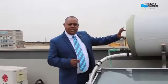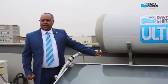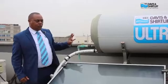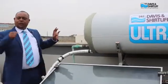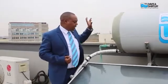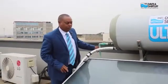Within the tank there is a heat profile: hot water, because it's less dense, will always be at the top of the tank, and cold water is always displaced to the bottom. So hot water is always at the top and cold water at the bottom. That is why our supply is always drawn from the top of the tank — we want to get water from where it is hottest — and it then flows by gravity to where you want to use the water.